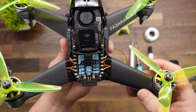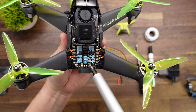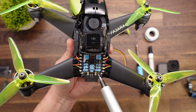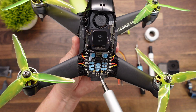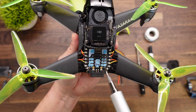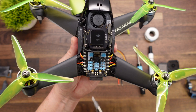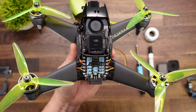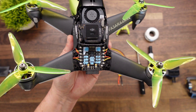Now that we have that off, the two points we're going to be soldering to are this spot right here and this spot right here. This is the VBAT spot, and this is the ground spot. VBAT means it is coming at the full 22.2 volts that a six-cell battery has — that the DJI FPV battery is. Make sure that the camera you intend to use has a built-in BEC to regulate the voltage so it can take up to six-cell voltage. I'm going to be using the Hero 10 Blackbones or the GEPRC Naked Hero 8 — both can handle two to six-cell voltage.